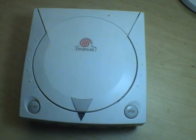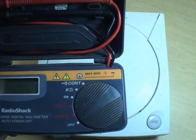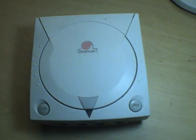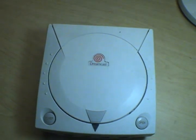The first one you want to look at is voltage. And right there on the top of my multimeter it says maximum 400 volts. So I'm not going to plug this thing into anything that says more than 400 V on it. And the UF rating, that's actually microfarads, think of it as amperage. It's how much capacity the capacitor has. Say that 10 times fast.